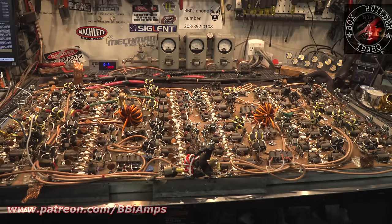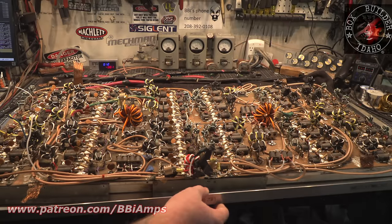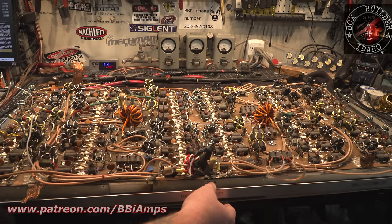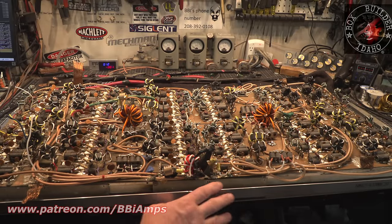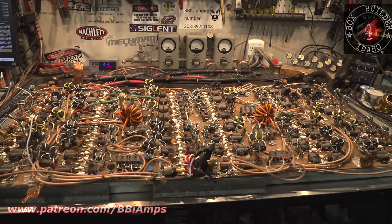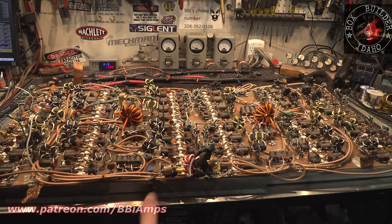Down both sides. Now the idea is that we're going to take this same piece of angle aluminum, same thickness, and for the side plates we're going to add yet a second runner. See how that's going to work out, and then we'll bolt the side plates to the angle aluminum. So it's going to be double rigid. We're basically going to build a half box, right? A little half of a square tube on both sides.